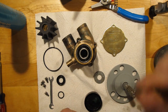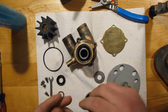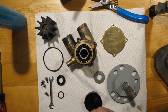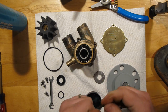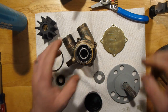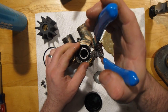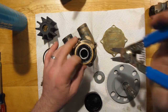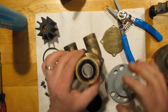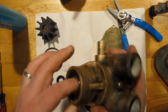To keep the bearings from coming out, we have a retaining ring. I am reusing the retaining ring that was in mine — I probably should be replacing it, but I don't have another one, so I'm just going to put the original back in. You're also going to need retaining ring pliers — handy thing to have. Just put that little guy in his little slot and in he goes. Now the bearings are fixed and locked in place.